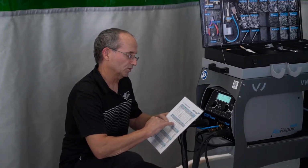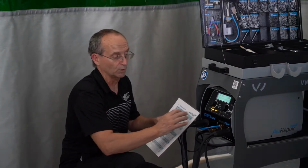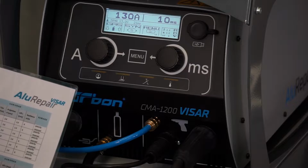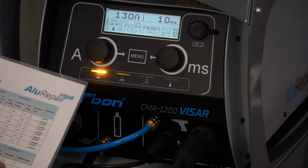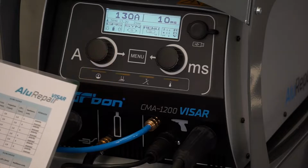As we go across here, our gas time is still going to be 1 full second, which we already have set inside of here. Our gas flow is going to be 10 liters per minute, which is still going to be 21 on the gauge that we set previously. Our lift is going to be 1 millimeter. Our resilience scale or spring tension is going to be 6.